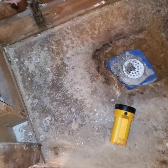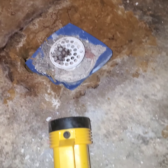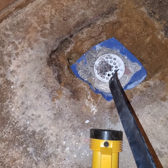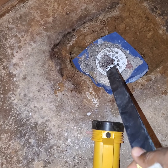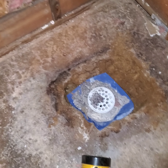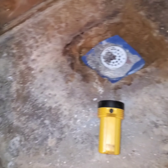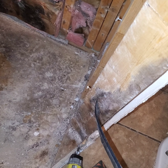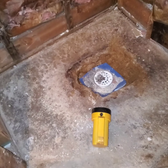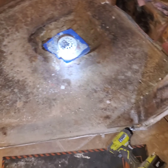This is what the bottom looks like. As you can see, they didn't bother covering up the drain and it looks a hot mess down there. I think I may have to replace the p-trap because that looks pretty jacked up. Nevertheless, the wood is not rotted out like I anticipated. There is some evidence of water but everything is pretty much solid, so I'll be able to clean this up and get the floor added.